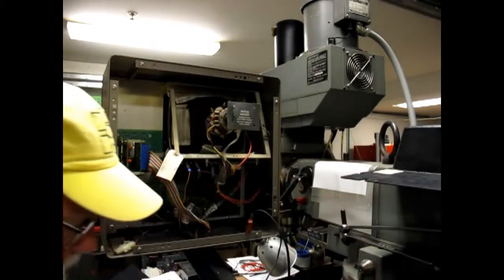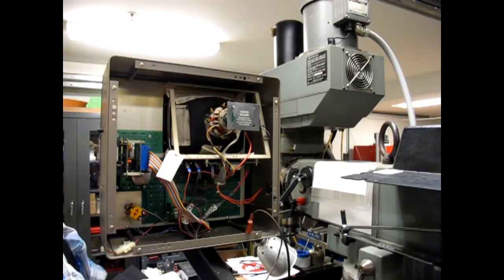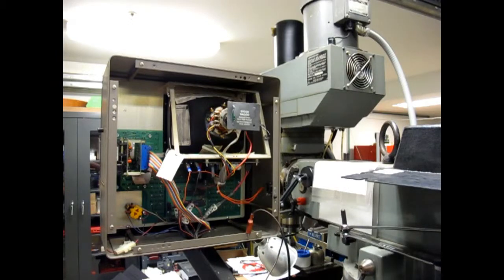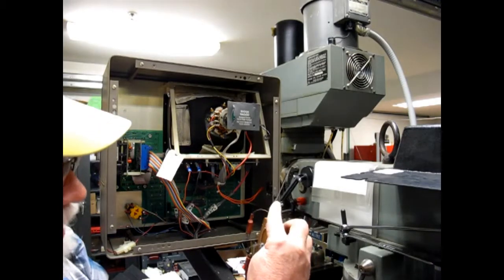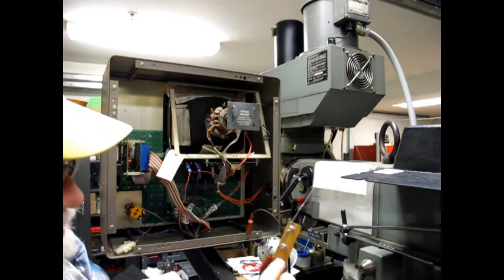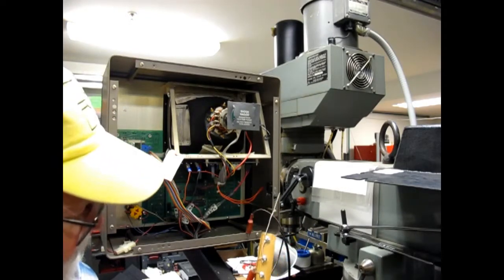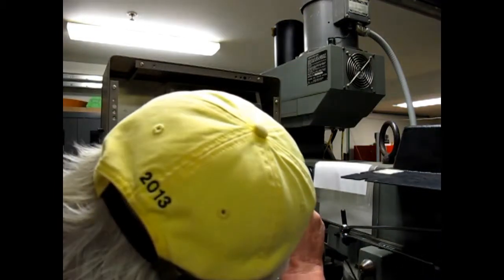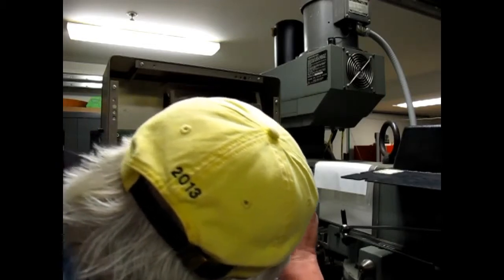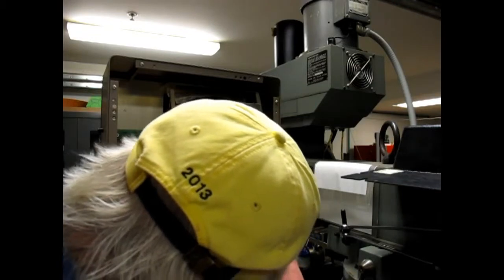Yep. Pause for tool modification. Okay. The recipe now is a little piece of stiff wire, 3 sheet metal screws, a 10 meg ohm resistor, and a test lead. Now we'll see if we can slip this underneath that anode cap. It is old and dried out.